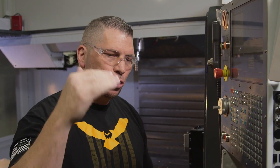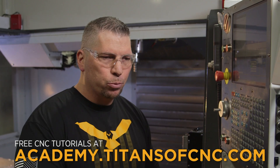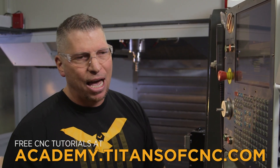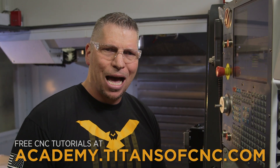So that's just a few ways that you can end your program. Make sure you double check your numbers, always run your program above the part, put it in five percent, take the feed rate down, and actually dry run it to ensure that everything is perfect. If you enjoyed this vlog, go ahead and hit that subscribe button, hit the like button, put your comments down below, because we're just going to keep bringing the heat — teaching you manual programming, teaching you CNC five axes, teaching you the entire trade. Have a great day. I am out.